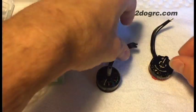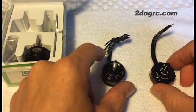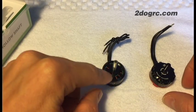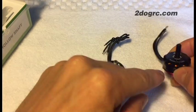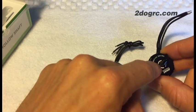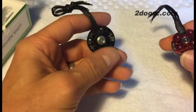Right off the bat, the DYS motors come with long motor leads if you need that. The DYS also has a hollow shaft, which the Emax 2205 does not. You can see the DYS has ridges or holes cut for extra cooling, and the Emax has them cut on the side, so it's kind of a wash. The Emax 2205 has little propeller arrows to indicate which way to tighten your nut based on motor rotation direction. Weight-wise, they're the same.